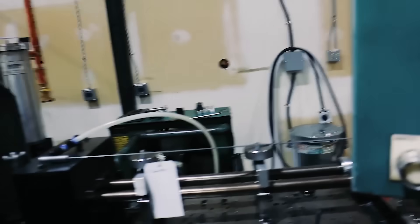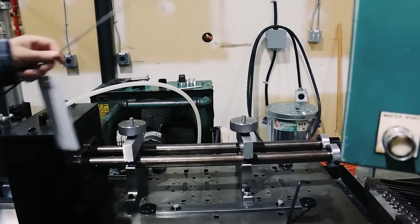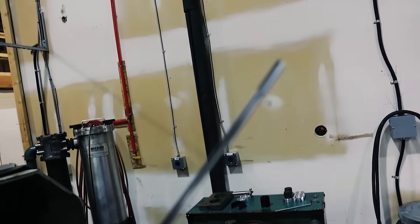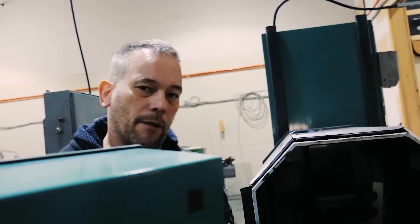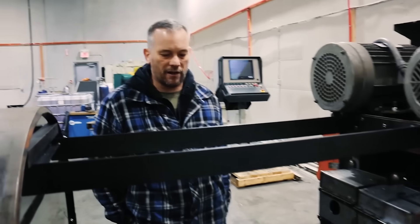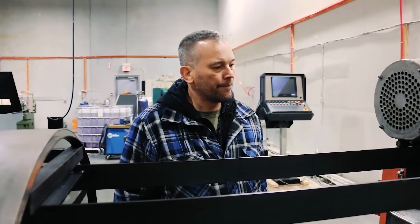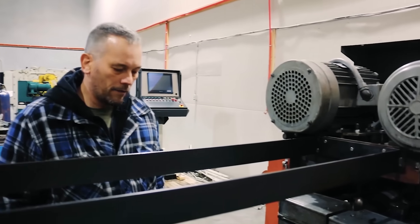So this is our gun drill. It drills two barrels at a time. What you see on top there is an actual drill — fairly thin, fairly flexible. It's got a groove right down the middle that helps wash your chips as it's cutting. On this one the drill spins; on our other drill the barrel spins and the drill stays stationary. That's our Pratt & Whitney gun drill — it's an old drill, made in 1917. Pretty much guaranteed to have made rifle barrels or machine gun barrels during World War II and all the other conflicts. Sometimes the old stuff is the best stuff.